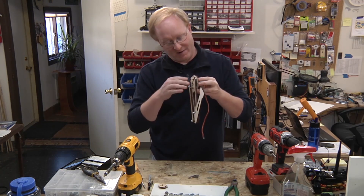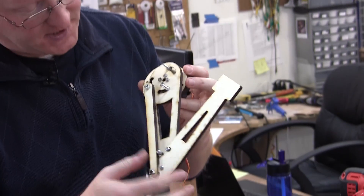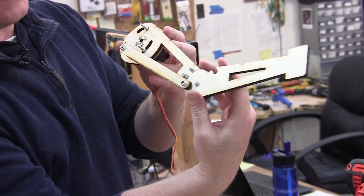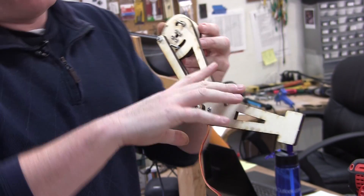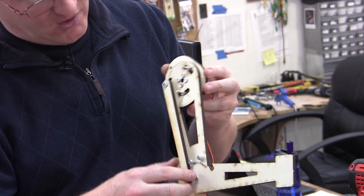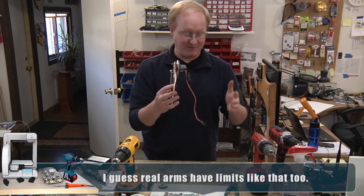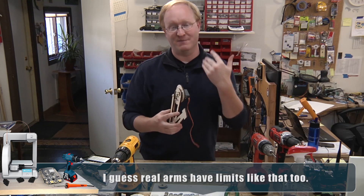There is a complete arm — it can guard and it can punch. These posts will make sure it stays within its extremities. If this post here rotated past the halfway point, the arm would flip and you wouldn't be able to retract it, so we keep it all on the up and up. Now that we have one arm working, we can make a mirror copy of it and then build another set of arms for the opposing robot.